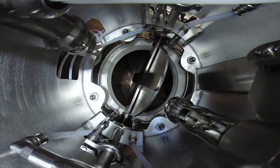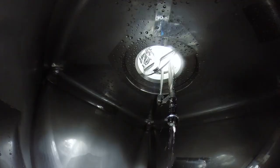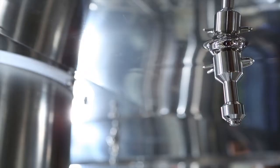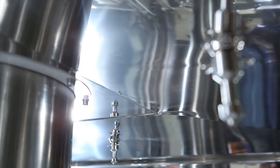After both of the flaps are locked in place and in the open position, the container washing process can commence. The container is washed from the inside through a dedicated washing nozzle and externally by the multiple fixed revolvable nozzles equally spread around the washing chamber.